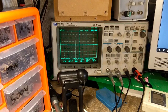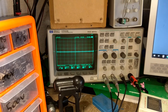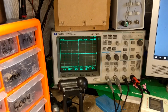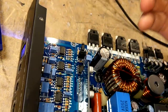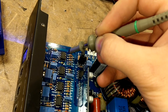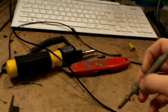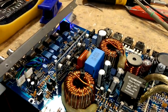On the 7915 we have negative 15 volts, so we've got plus and minus 15 volts from these regulators — they're working fine. We can confirm they're making it to where they should be by checking on the op-amp pins for the preamp circuit. On pin 8 we should have plus 15 volts — yes, correct. On pin 4 we should have negative 15 volts — yes, correct. So those are working fine.